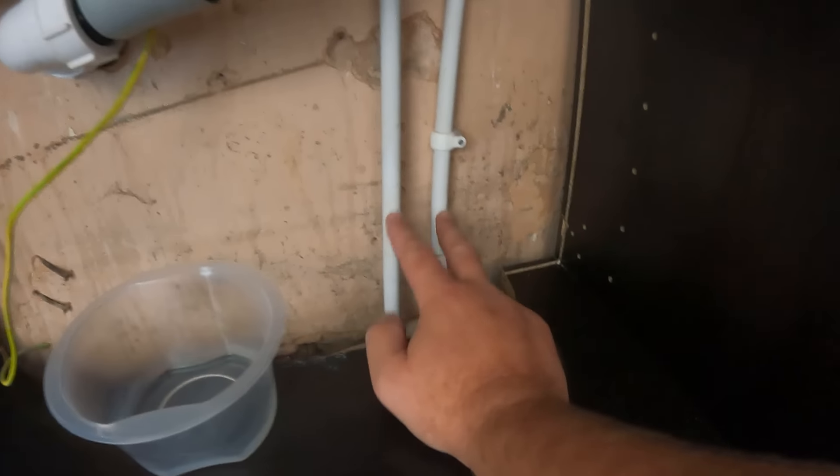We've got the kit out — we've got the Nurad TapX kit to get up to the back of this sort of half-Belfast sink, because we know that's going to be a bit of a pain. The water turns off under there — I've already done it, water's off to the tap. So first things first, let's get those two isolation valves cut into the pipework.